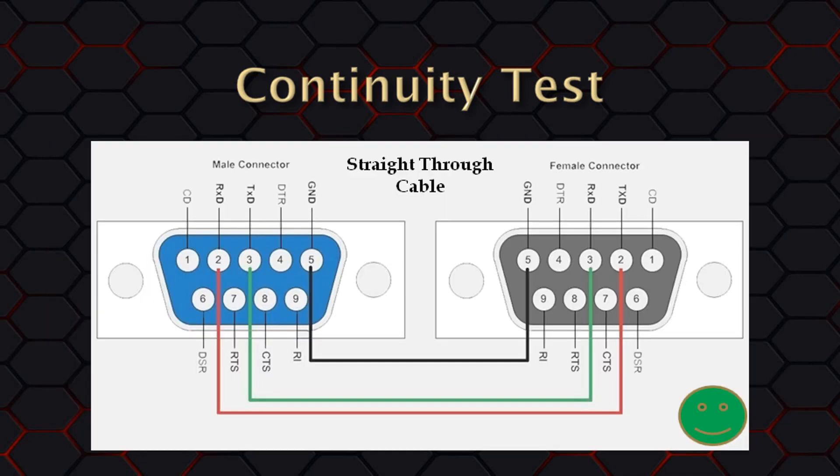Let's look at the connectors on both ends of the serial cable — usually one is male and one is female. The pins are numbered, but the numbers are very, very small. On the male end with the row of five pins on top, pin 1 is the upper left and pin 2 is the next one to its right. On the female end, the numbering is the mirror image, with pin 1 being the upper right pin. For serial timers, only pins 2, 3, and 5 are used to communicate, so those are the only pins you need to check.